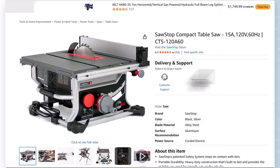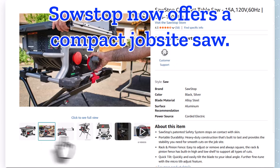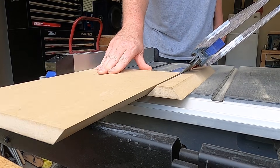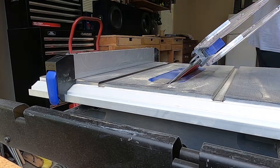Level three is where you want to get either a starter table saw or a good track saw — they're going to run you about the same amount of money. If you go the table saw route, I'm going to recommend you spend a little bit more and get a SawStop. The table saw is the most dangerous tool in your workshop. The SawStop doesn't fix the biggest problem — kickback — but what often happens in a kickback is you'll be holding your material, and as the kickback happens, it'll draw your hand across the blade and cut off your fingers. You'll still get punched by the wood, but at least you'll have your fingers. Kickback scares me especially because I'm six foot three — it's not punching me in the gut. If you go with the track saw, you'll be able to save some money at a later stage.